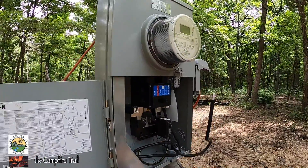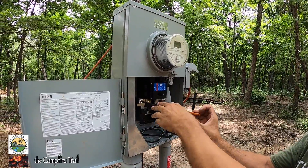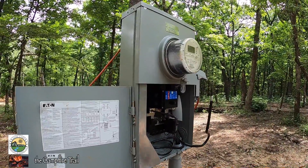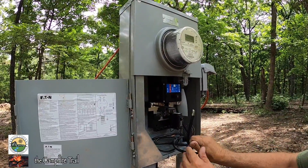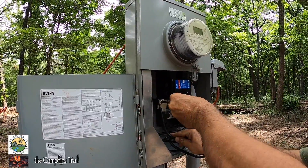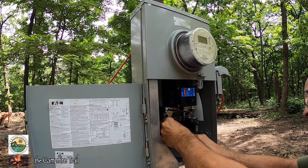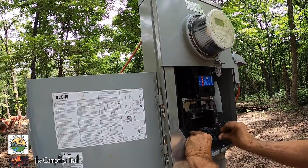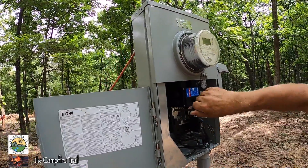This is the side that makes me nervous. Well, I was touching it — it's dead. It's exactly as I expected: dead. It should be, because the breaker is off, but it was still showing a phantom live reading, which always makes me a little nervous. I've just run into that before so it doesn't surprise me, but it's still nice to know it really is dead.